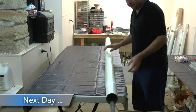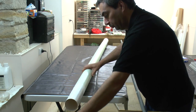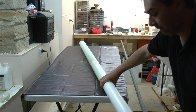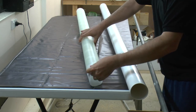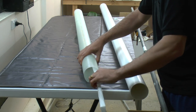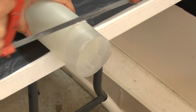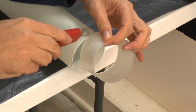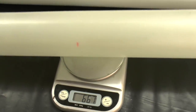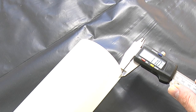After it's cured we take it off the mandrel and it does come out fairly easily. Then we pull the baking paper out — that also comes out fairly easily. We trim the ends, give it a sand and a nice square finish. That weighs about 670 grams by itself and the wall thickness is 1.1 millimetres.